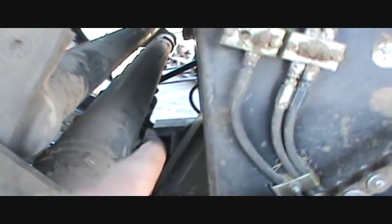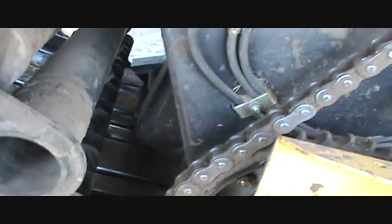Anyways, these are greased. These are all run off of this grease gun. All the greasing points. That's what these hoses and stuff are. Even the packer forks, those things are greased. This is oiled, automatically oiled. It's loose now and actually needs to be changed because it's starting to wear on that.